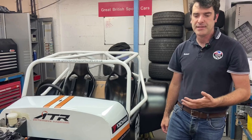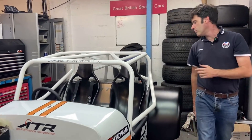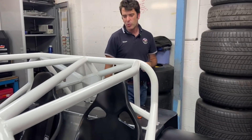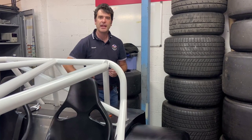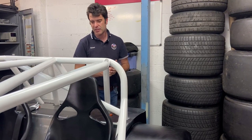One thing to note: don't do those front wing cutouts on the road in the wet — you get a hell of a lot of water coming through, it's surprisingly bad. We've done a similar thing on the rear, with cutouts in the back of the rear wing as there's quite a draggy area building up in the wheel arches. The rear diffuser also has a NACA-duct-style cutout in it. This was more from a temperature point of view — when we were running smoke through the nose we found the airflow was stalling down the center of the tunnel. We wanted more airflow over the diff, and putting that cutout in helps draw it out. It didn't make much difference on drag or downforce; it was mainly to pull a bit more cooling air through.